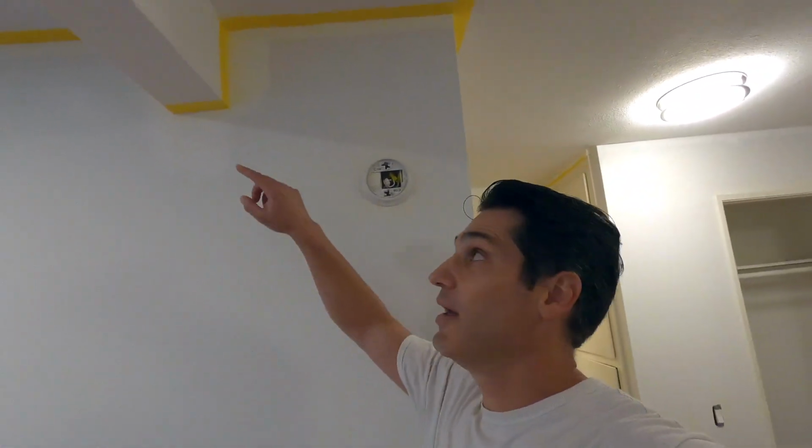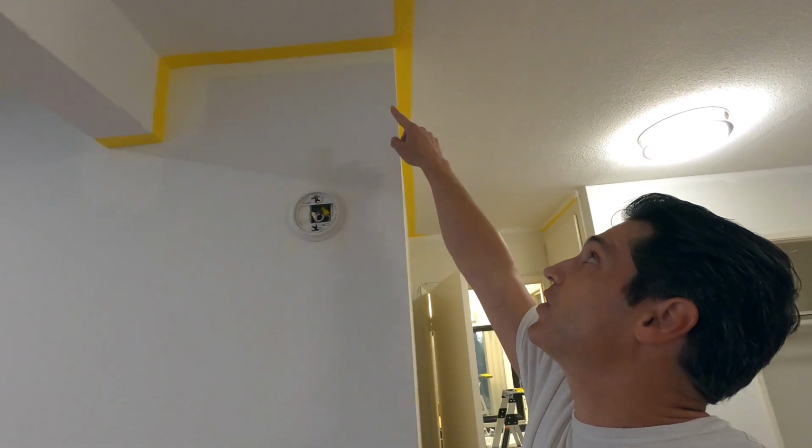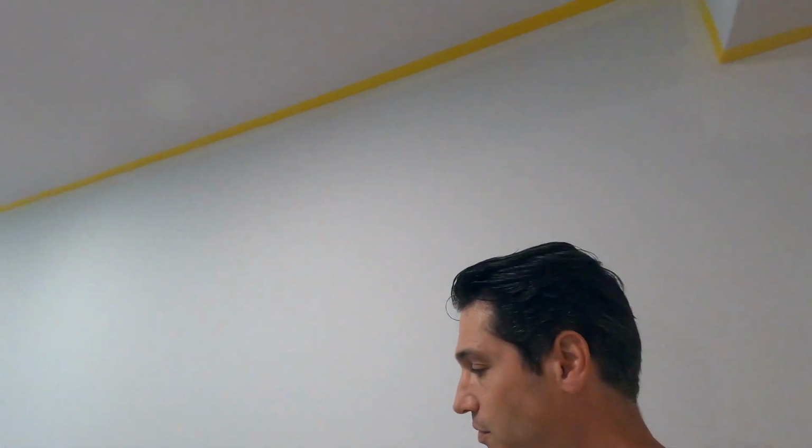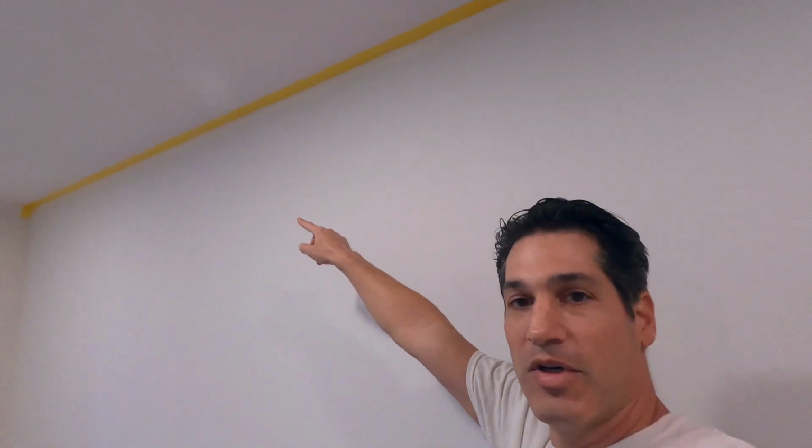And I'll explain to them what I do is I take a painter's tape and I run it along the ceiling. I'm going to show you what I do. I take this painter's tape and I put it up on the ceiling. I'm going to show you how it looks over here. I run the tape along the ceiling and I bring it in about a millimeter. So there's a little teeny gap between the wall and the edge of the ceiling. So I'm painting up onto the ceiling a little bit.